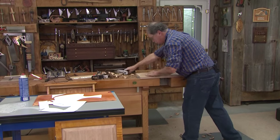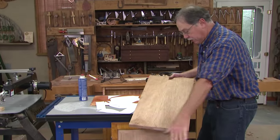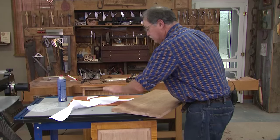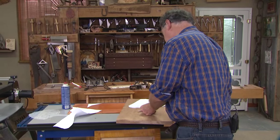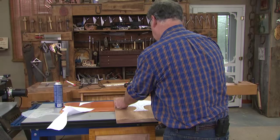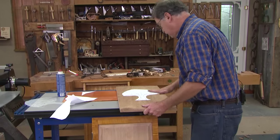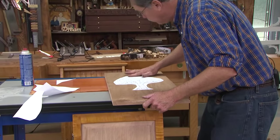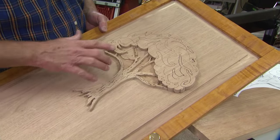The clock is ticking on that glue — if it air dries too long it won't be sticky enough. Also, you want to work around the workbench, so never push it up against the wall. A couple more smoothing passes and we're going to cut out our pattern. Now that's ready — there's the grain, cathedral arches up. You want to center the tree up and leave room for the name. Balance it left and right, press it down, and check for any lifting on the pattern.